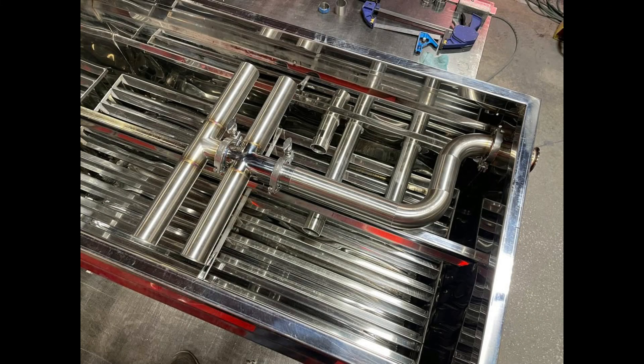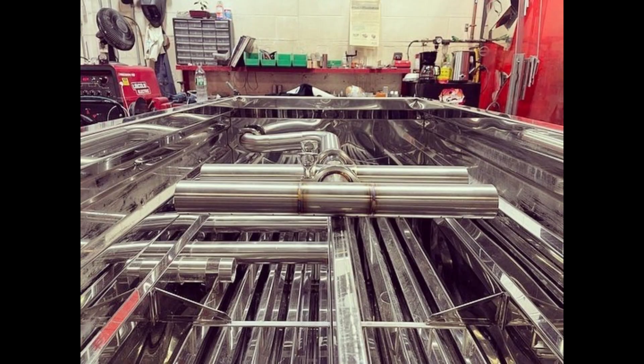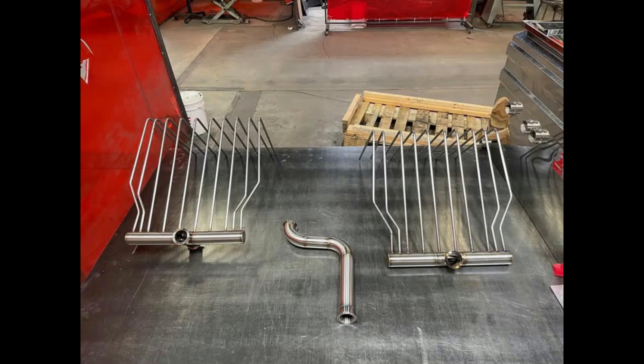Connor at Leader built my bubbler. You can see he started with the layout of the pipes coming in to supply air to the manifolds, then he welded on the different pipes that drop into the bottom of the flues. Those all have air holes in the very bottom where it lays on the bottom, and it's a three-piece design inside the flue pan.